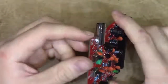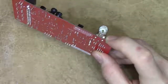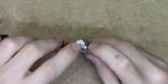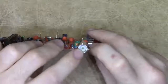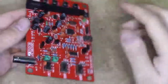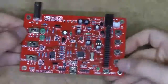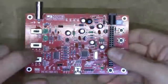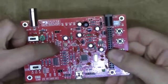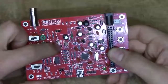When I had the BNC mounted, the centre pin was about 2mm off-centre, which isn't good enough — it never quite fits a BNC connector properly. I'd also forgotten, when first testing this thing, to short a little jumper which the instructions do tell you to do. It still worked, but I think it had a bit of an excessive DC offset. Once I shorted it, the DC offset improved.